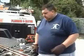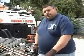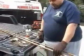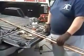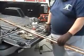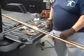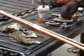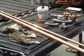You need a couple of fittings and you need the right pipe for the right job. There are different grades of pipe. L pipe is for domestic water. M pipe is for heat. So you got to make sure that when you're doing your project you know exactly how to identify the pipe. You identify the pipe — it will have a blue label going all the way down the line, and that will tell you that it's for domestic water.